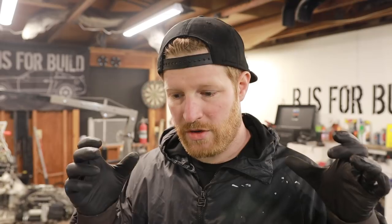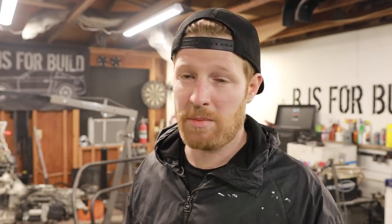It's completely acceptable that this is taking time, because fabrication-wise, this is the most important and hardest thing to build on the entire build — figuring out the mounting points for this rear subframe. For the front rails it's just drilling holes in a precise spot and reinforcing them, and bolts go straight in. The rear frame rail we're building out with changes in elevation — a lot more work. So I'm perfectly fine with it taking more time. Tomorrow's episode we'll jump into the Datsun — we're basically going to harvest the body, fenders, hood, and all that good stuff. Should be a lot of fun to work on a car that's much older than me.